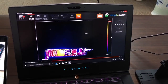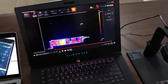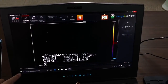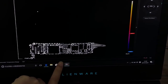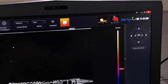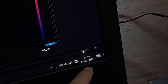In the review video, you may think you can easily find this big heat point by lip or by finger touch, but you can click this button. Click the one-click button. Okay, you can see there is an automatic temperature range. Just now you could see a very big area, and this whole big part is at a hot temperature. But by clicking this one-click button, it will be fast to locate the problematic temperature range. So the problem must be in this range.